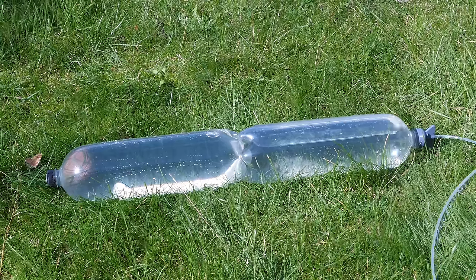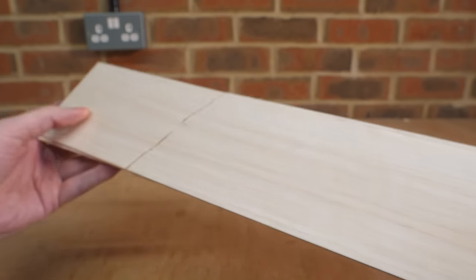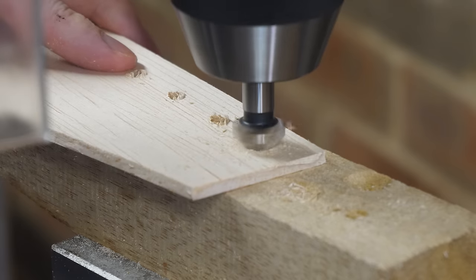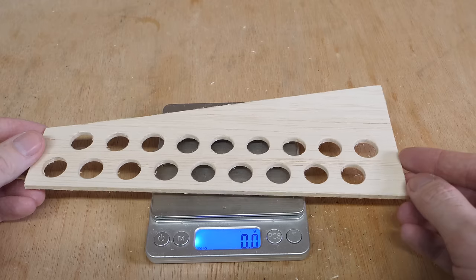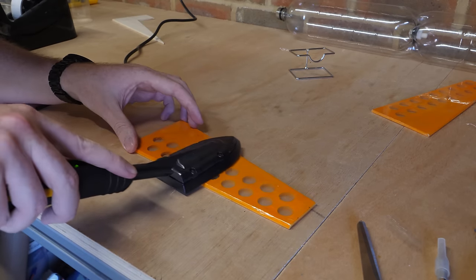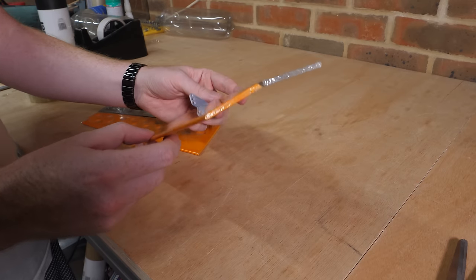It's time to build the tail of the aircraft. For this I chose to use balsa wood sheets, but the 4mm stuff is a little thick, so I ordered some 3mm sheets — which were, believe it or not, shipped in a paper bag. To reduce the weight of the thicker sheets, I drilled some holes — first with a small drill bit, then with a large countersink bit to reduce splintering, and finally with a 3D printed bit wrapped in sandpaper to make the holes nice and smooth. This reduced the weight by about 20%, and after a few coats of paint, it can be laminated with the covering film to stop air flowing through the holes. I then added control horns and attached the control surfaces with packing tape, as it's lightweight, flexible, and sticks well to the covering film.